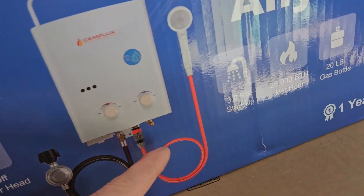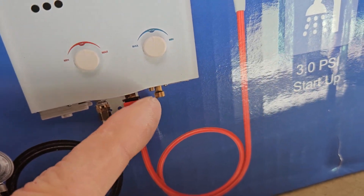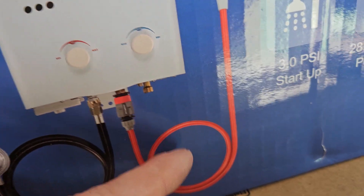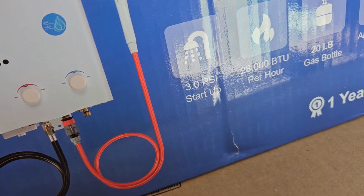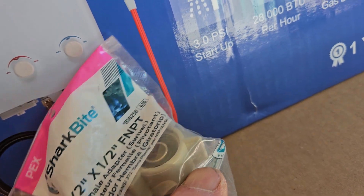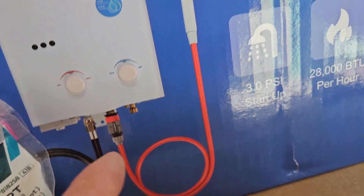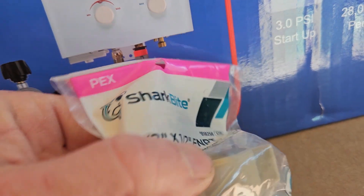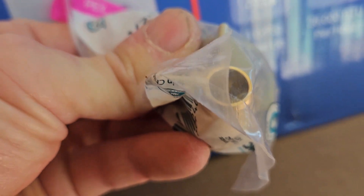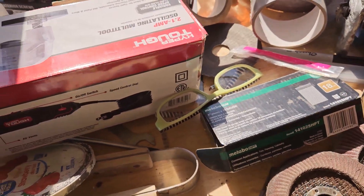On the bottom here it's got two in, one in, and one out. It comes with this hose but I'm doing away with that. I got the SharkBite — that's the brand — and this is gonna screw on to the bottom of the tank where the red is, the hot side. I got one for the cold side. It sits on the outside and the PEX is gonna come through. I was gonna use the other PEX, the actual expanding PEX.